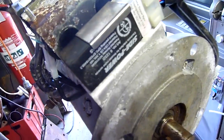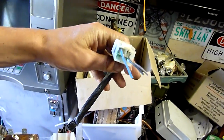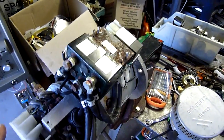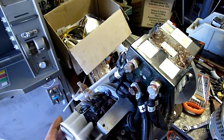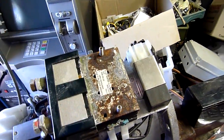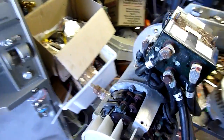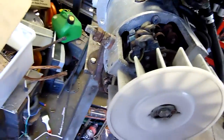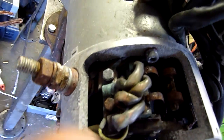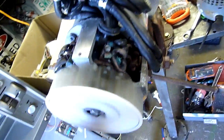Bearings will need to be done. It's got the electronic interface module still on it — again everything's corroded. I'd say they've had an incident; it doesn't appear to have been fully submerged, it looks like it's just been gradually sprayed with water over a period of time, and some parts are rusty and some aren't, so I'd say it's just a bit of gradual death. There's a little sensor down there — it's almost like a thermistor — could be a suppressor actually, an anti-arcing suppressor.